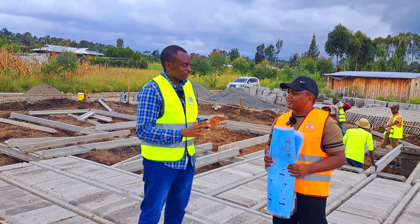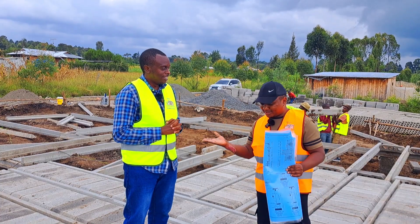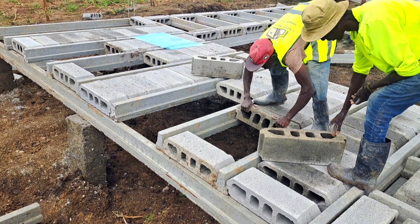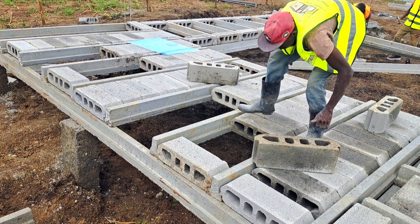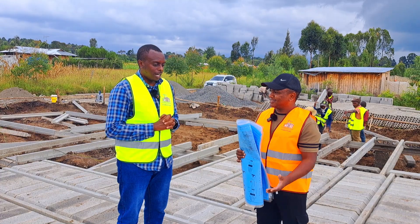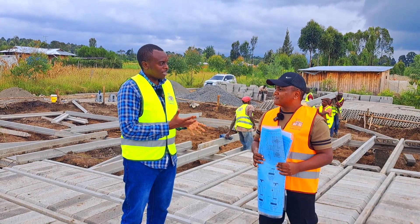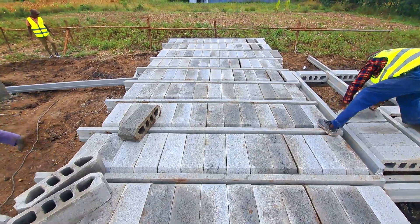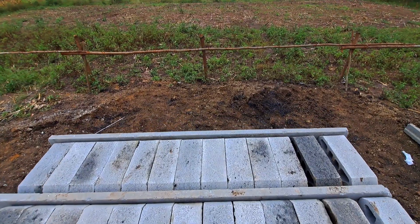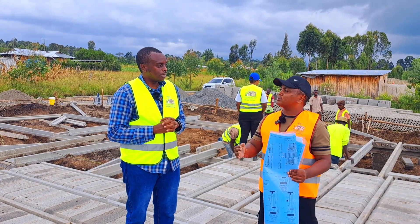You are sure this is a strong foundation for the client — as an engineer? Yes, I perfectly do. If you know the beams — in the suspended slab we use it for spans of nine meters and six meters without any support beneath, and you're assured it's okay. This is basically a suspended slab for the ground floor. Also, I've noticed some beams are longer than others — some are short. Is that part of the structural design? Exactly. When doing the layout, after column positioning, we do the layout of the beams with different orientations to attain shorter spans for maximum strength.